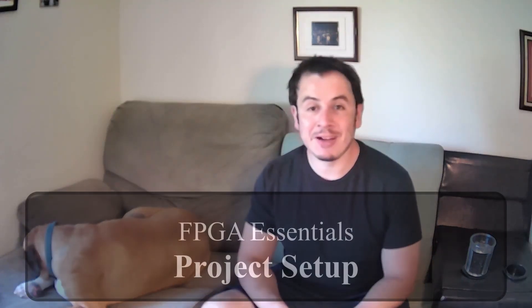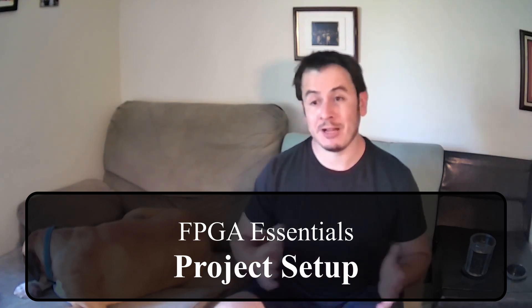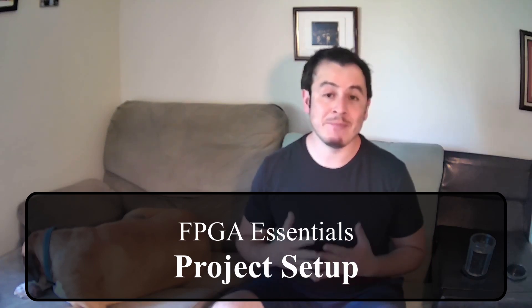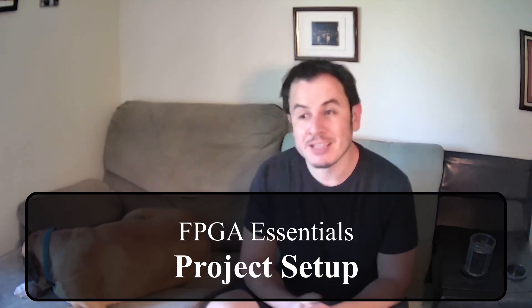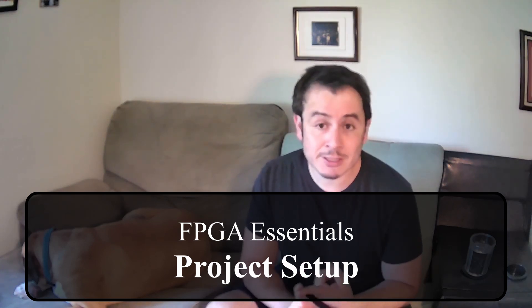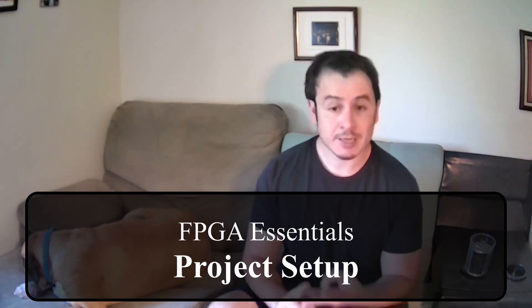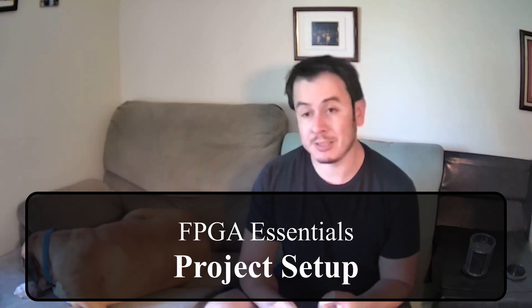Welcome to Made by Ozzy. Today we're going to take our very first step on our thousand-mile journey. We are working on an FPGA-based gaming console and crypto miner using the DE0-CV FPGA development kit. Our goal today is to get the FPGA development software downloaded and installed, set up a project configured for the FPGA on our dev kit, and then do the simplest possible FPGA program — tying one of the buttons to one of the LEDs.